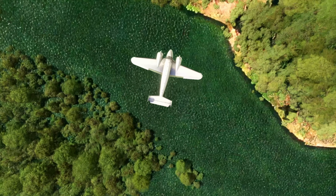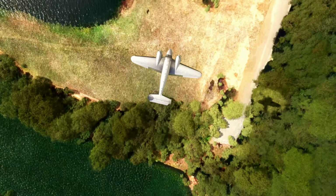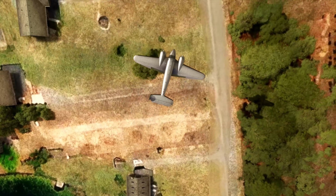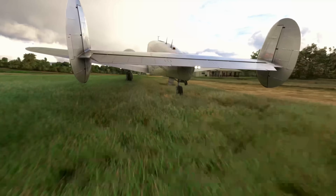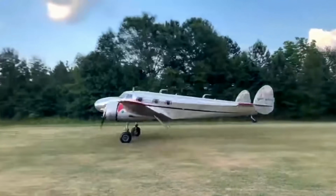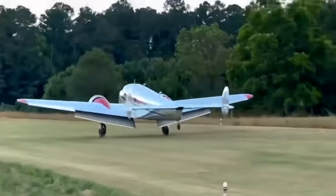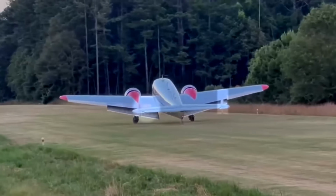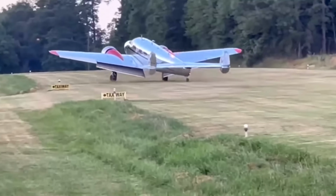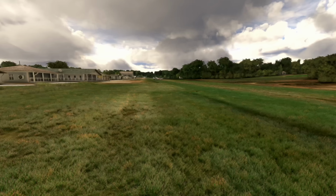If one brake has failed, particularly if the tail wheel is freecastering, a turn opposite the failed brake is a guarantee. The condition of the tail wheel lock is relevant, but it's also easy to overstate its impact. Ignore the tail wheel here and focus on the rudder. Glenn almost immediately applied right rudder, and as the aircraft swerved to the left, he rapidly applied full right rudder. Likely at the same time, he applied full right brake and released the left brake.